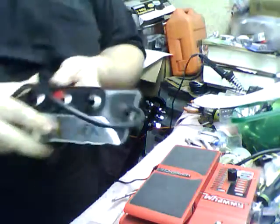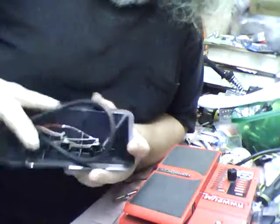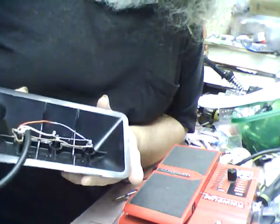And we're going to take this really crummy clone I put in an old PV foot switch of the Digitech FS3X or whatever they call it. This is the same circuit as what's in the schematic that's posted online. You can see there's two little diodes inside here. Kind of hard to see. But all it is is 3 momentary, normally open switches. So when you push them, it makes a contact.